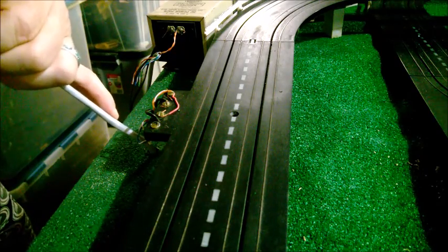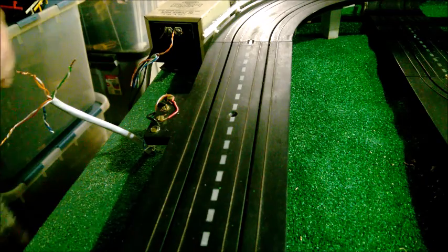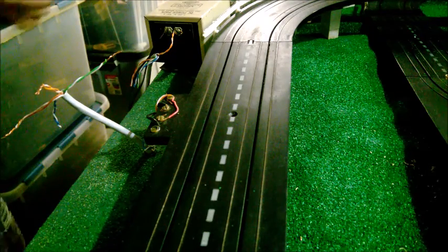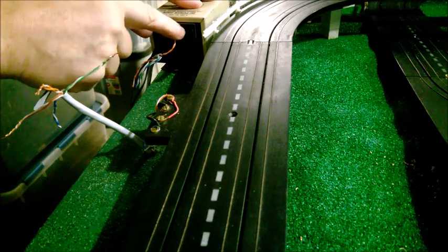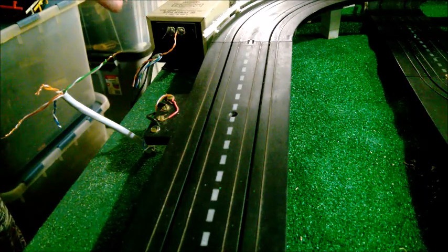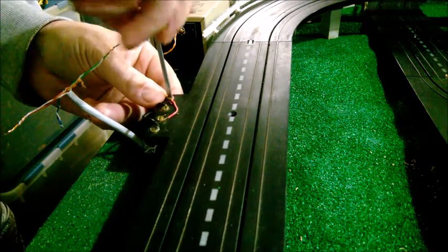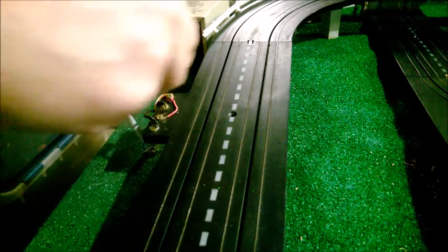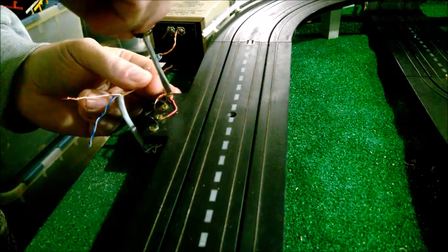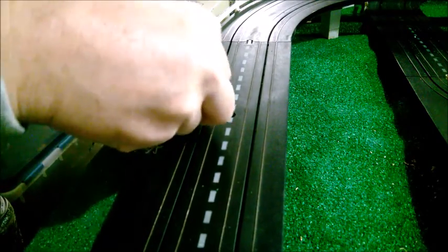This time I'll take the brown — actually I need to run all the wires over. The sections are wired and I'll go back with wires all stripped. You want to keep these color-coded the same. The manual doesn't show you how to do this, so this is something you have to figure out on your own. The power wire from the right side of the transformer goes to number one, so make sure you color code the wires the same when you go to that other terminal.